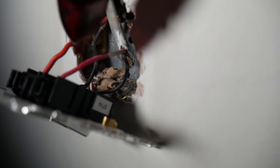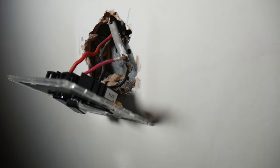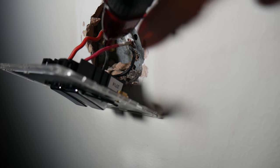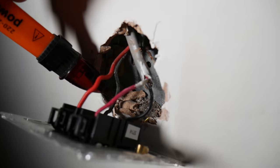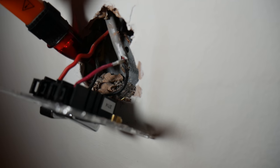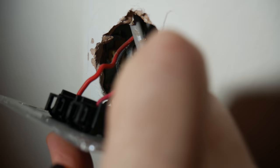I'm going to touch the wires here. Can you see what's happened? So this is a live wire, this looks like a switch live wire, that's a live wire, and that one's the switch wire. So this one and this one go into L1 and L3, and these live ones will have to go into the live terminal. Just to show you — as soon as I switch this on, the switch live should be live now. There you go. I turn it off and it's dead. Same with the other side — I turn it on and you can see the power going through it.